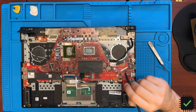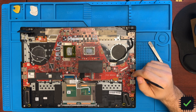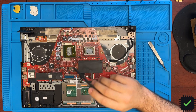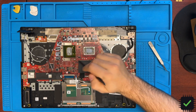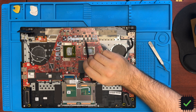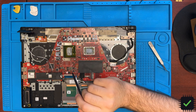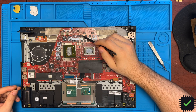It was actually shorted to ground. I injected about one volt and it was taking about one amp. I checked with my thermal cam and nothing was really heating up. So I decided to take the heat sink off and poke around the processor area. I checked the coils near the CPU and it was the same — short to ground. That indicates some of the MOSFETs on the CPU side went out.